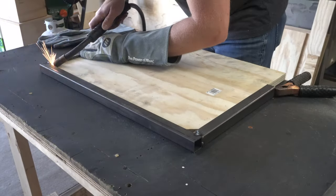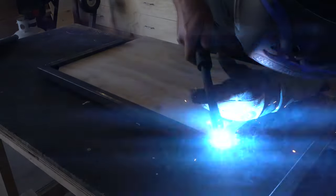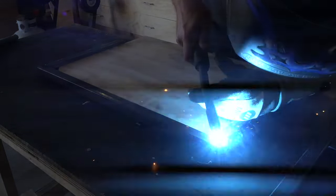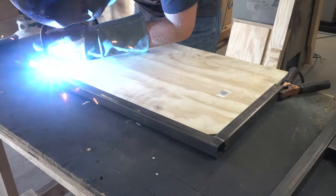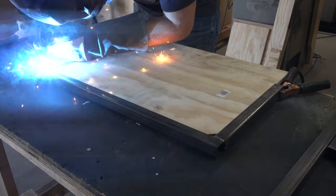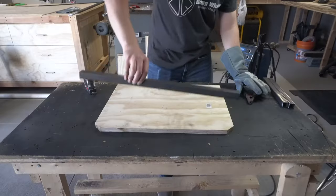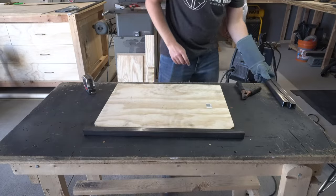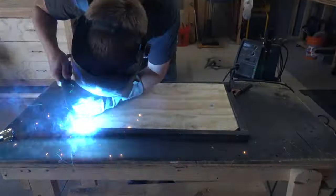This was a lot of short welds but I tried my best to stay at the area I was welding on so I wouldn't be concentrating all that heat in one spot for too long. That could end up causing warping and in the end cause the table to wobble. This is pretty much rinse and repeat for both tables, so sit back and enjoy a welding time lapse.